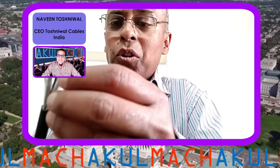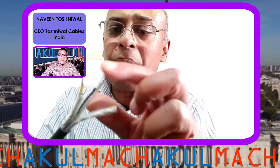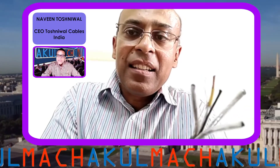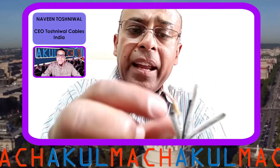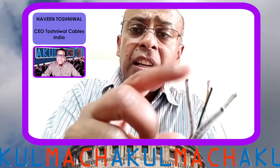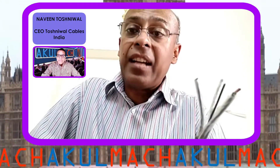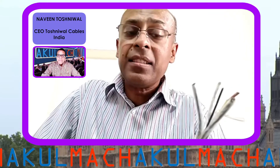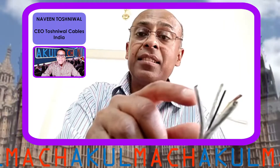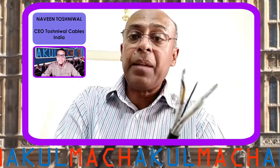This is a four-pair cable. It has four pairs inside. The conductor size is probably 0.5 square mm. What you will note about this cable is that each pair has got a shielding — we have discussed shielding earlier. This is to provide electrostatic interference reduction, so that when these cables carry low voltages, interference coming from outside power cables and other heavy electric cables is not allowed to penetrate the signals these small cables are carrying. So four pairs means this can carry four sets of signals.